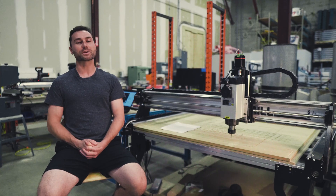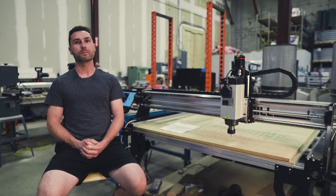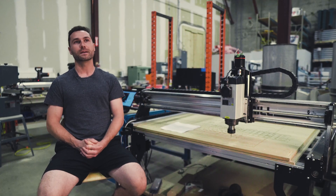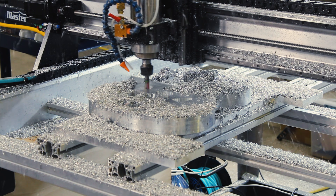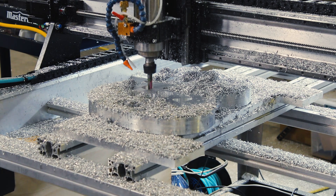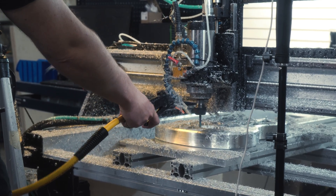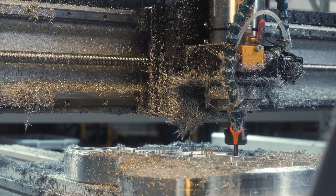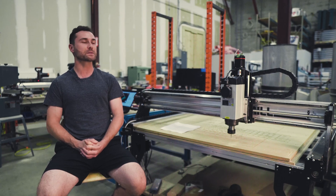If you're looking at machines capable of carving aluminum, this is one of the better platforms for the price. As far as tips and tricks: definitely use coolant — a couple of times we ran out and you could immediately tell based on how it sounded and how the chips were coming off. Air blasting to keep chips out of the holes is also critical, especially doing deep pockets with such high feed rates where chip packing was definitely an issue.